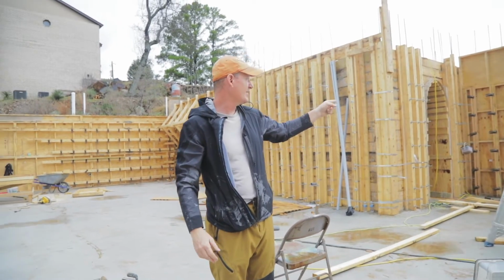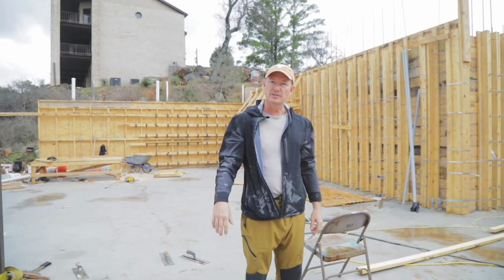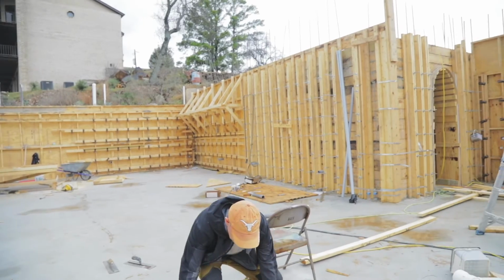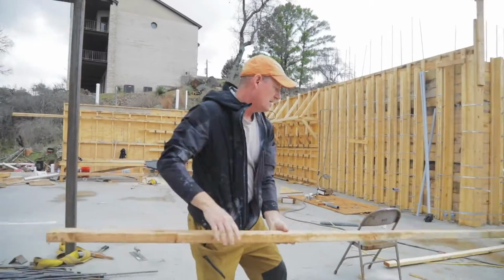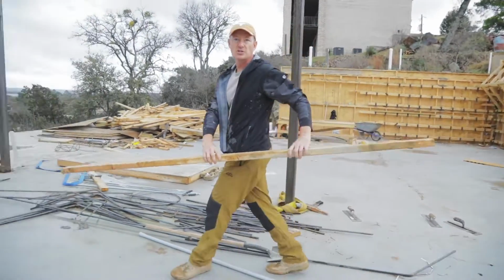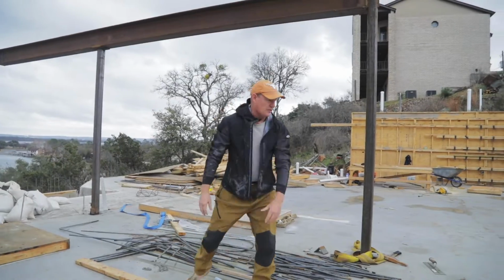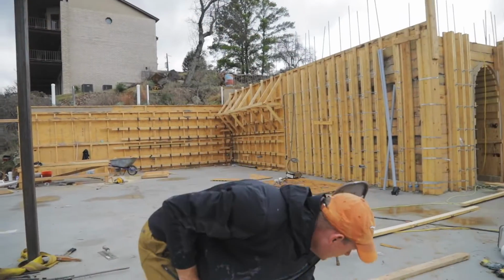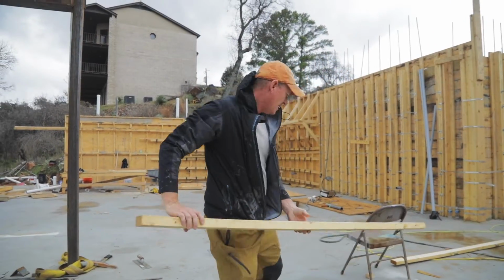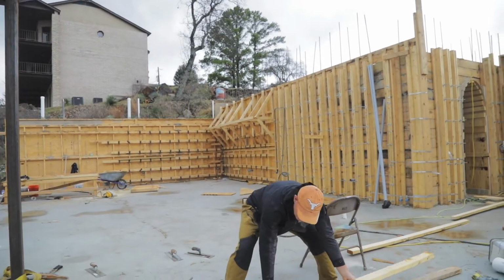And then like what I did in there with those glue lams. So I bought the glue. So if you notice on the glue lams, I take all this scrap wood we have. I mean, you keep it going. And this is how you make a structural member in your house. So you take all the scrap. It's all going in the dumpster. Then you take another piece of scrap and you make sure it overlays like this.